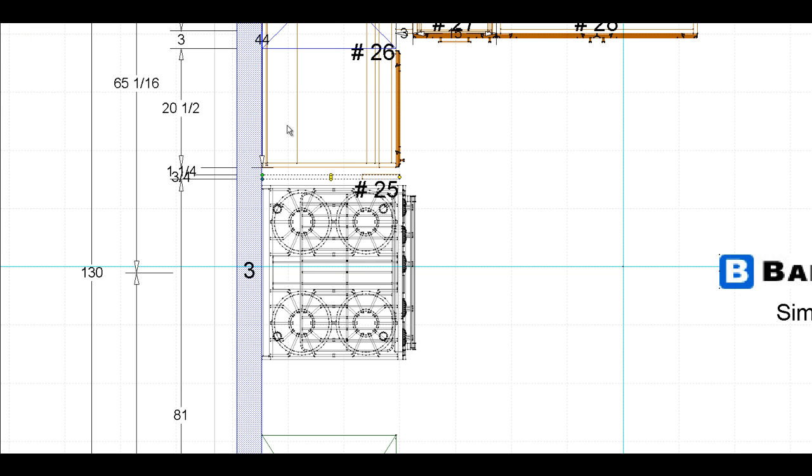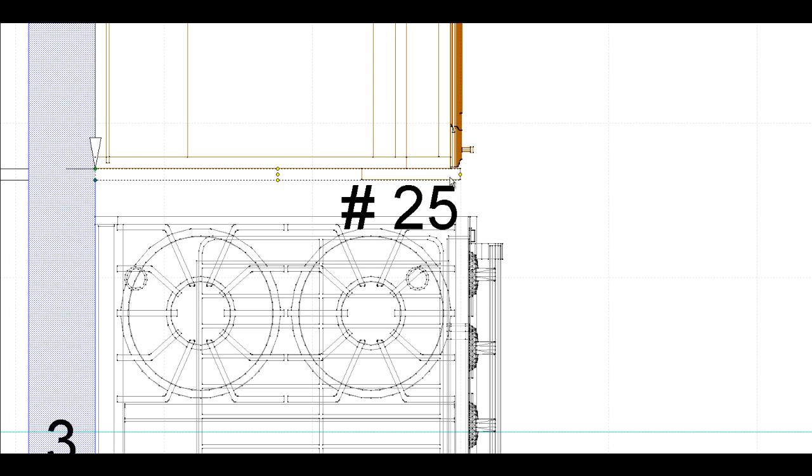I am now going to place this on the edge of the cabinet. So see what I've done right here is I've put this 6 and 5/8 wide filler from this point to here, 6 and 5/8. You don't have to get a full depth one. There's just no point in that. There's no reason to spend the extra money on the material.